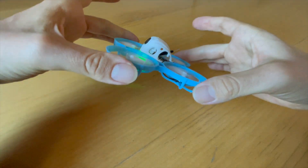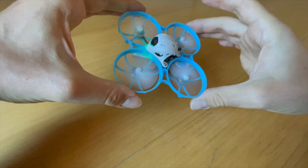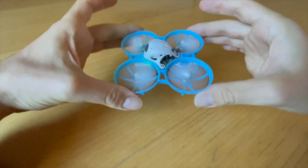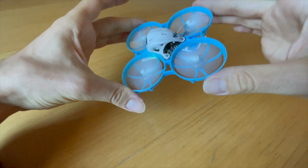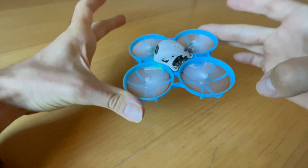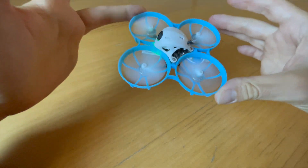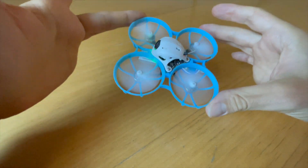To do this I feel the vibrations with armed motors. I tilt the whoop to each corner. The motor in the lowest duct rotates the fastest. If the vibrations become stronger in that corner I know that a propeller or the motor shaft is bent there.